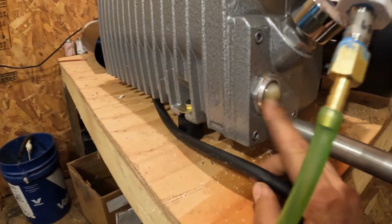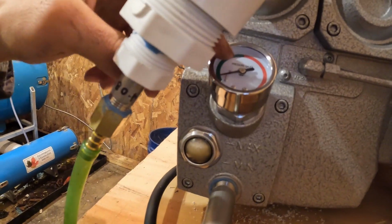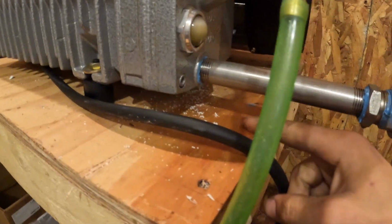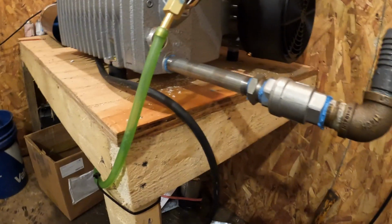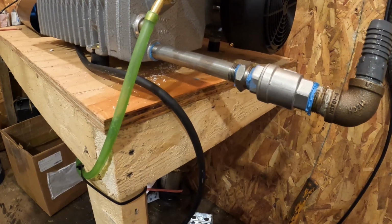Two things you need to check daily on this pump are the oil level and also the little gauge right here. This is the exhaust filter. We don't change it often because it's expensive, but there's also the oil filter over there. This one is changed every time I change the oil. I like to change the oil twice a season, at the middle and the end of the season. This little installation here saved me a lot of time and mess with the oil. Just a ball valve with a little pipe to take the oil out and in.